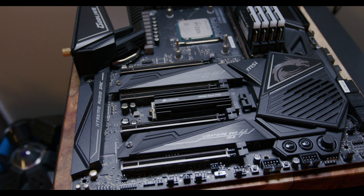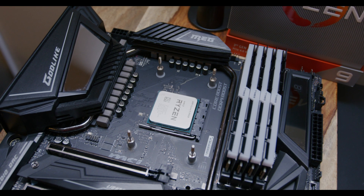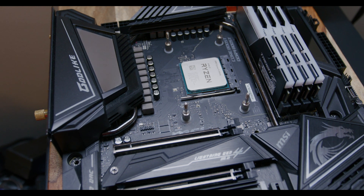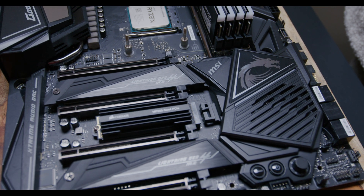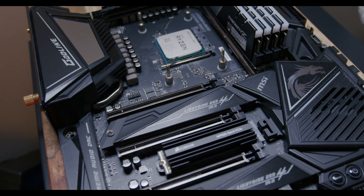My first impressions of the board were pretty good. It does have all these little features, but that's where we come to our first negative. Even though it has all these features, you can't necessarily use everything at once. You're going to be limited by the number of GPUs — even though it technically looks like you can use four, it's really hard to use four because of certain power restrictions on that fourth GPU, as well as how it splits the PCIe lanes. You can't treat it like a Threadripper or X299 motherboard.